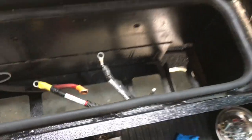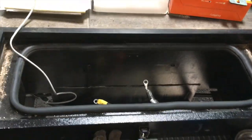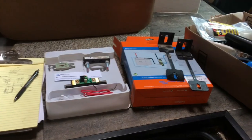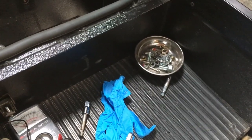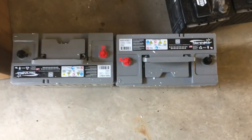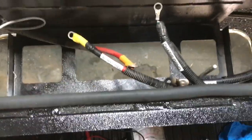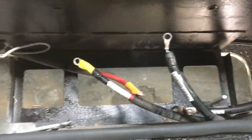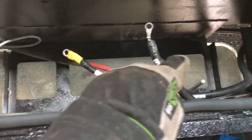Now I've removed the two batteries, labeled all the wires, and removed the main fuse so we'd have room for clearance. I worked laying everything out in order and used a magnetic container so I wouldn't lose all the nuts and bolts. I'm going to need 26 inches across to fit those two batteries into the compartment, but the vertical bracket here is narrower than that. There's plenty of room left to right, but I'm going to have to grind off these two ears.